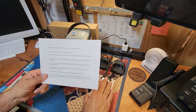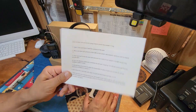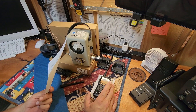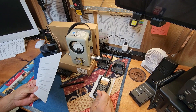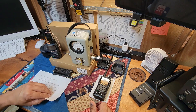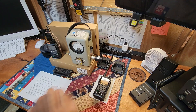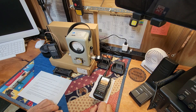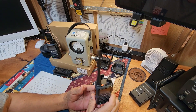On certain radios there are step-by-step instructions for using CHIRP to correct the channel 17 bug. I don't recommend programming these radios via CHIRP — Retevis has their own software, which I'll put in the description below. Those steps did not allow me to open up channel 17 to put a name in, so it's just going to be no-name channel 17. Retevis always seems to have some little bug — like on the RB25 mobile unit in my Explorer, it always reverts from narrow band back to wide band even though I've programmed it many times. I just wish Retevis would fix these things before releasing the product.